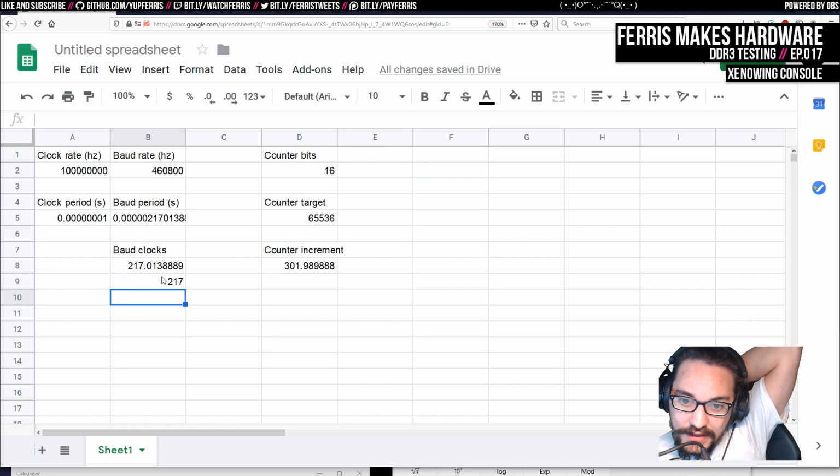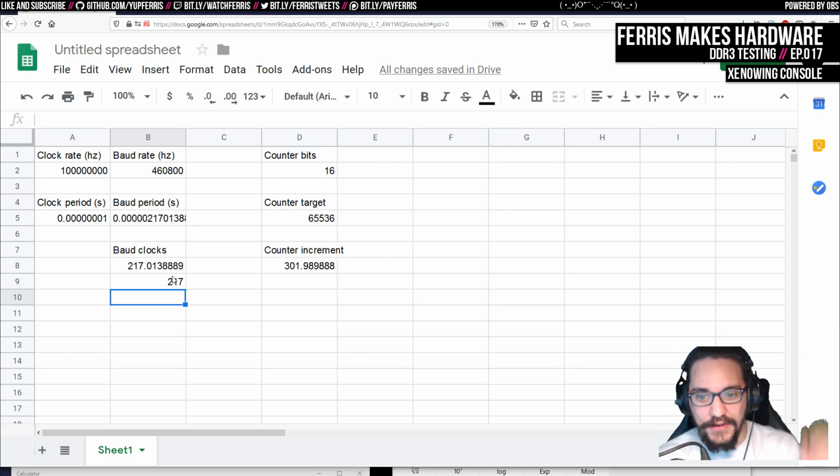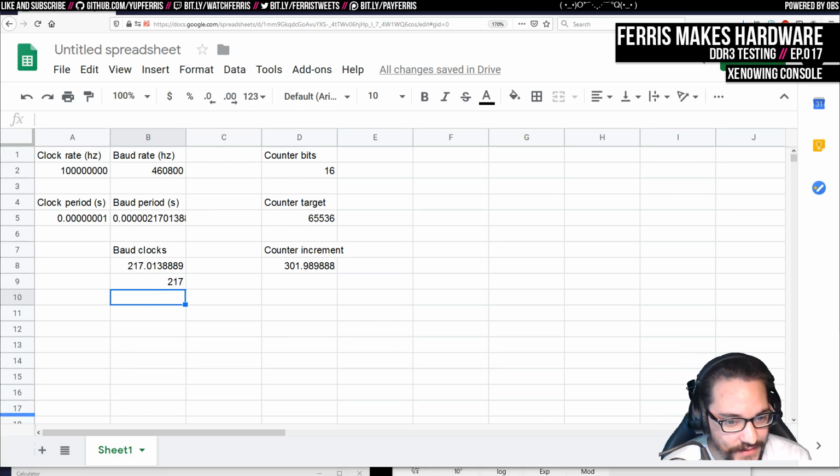So I'm wondering if we can figure out this math in such a way that this gets better. Because I think in Verilog too, you can also figure out the amount of bits that it requires to represent this number, which I think is a string bits. Or is it clog2? Is that what it is? Count log 2 or something? I think that's what it is. I just seen it in some code. I think that's what that does. Turns the ceiling of the logarithm of base 2, right?